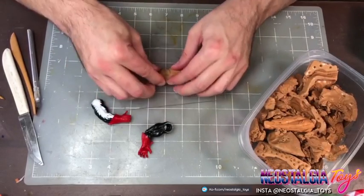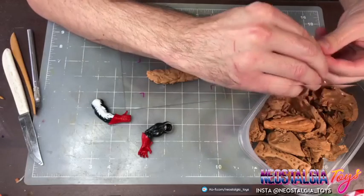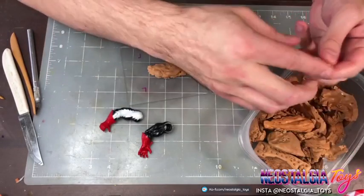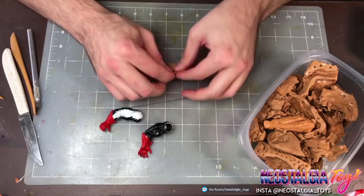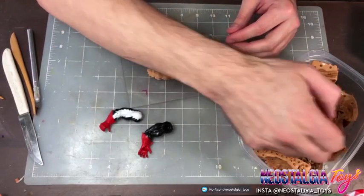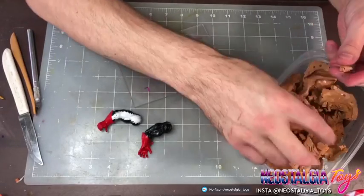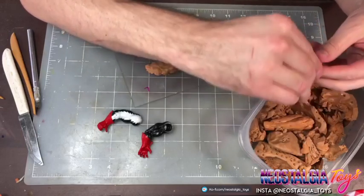Despite the screw up of that mold, I'm still pretty happy about the torso stuff coming out well, because that's going to be much better. I can at least start casting torsos from that and move on with another part of the project I'm trying to get ready. So I'm going to make a mold of three or four of those torsos to let me cast multiple copies at one time. The one we made over the last few sessions was essentially a master. So I'm going to make a few casts from that master, do only basic trimming, and then use those to create a second mold with multiples in it.